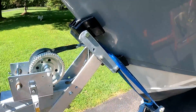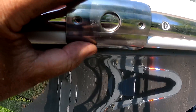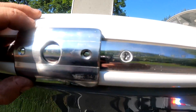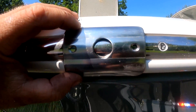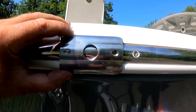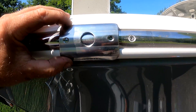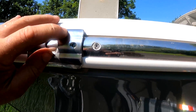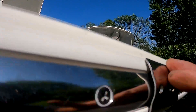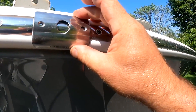Let me show you on the side of the boat. I actually beat this belt buckle to fit my profile, but out of the box this kit does not fit the one-inch stainless steel rub rails — absolutely does not. You would need to take it to your bench and beat it with a rubber mallet to take some of the crown out, and even then you're not going to get it perfect.